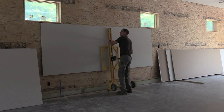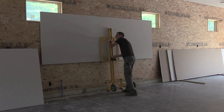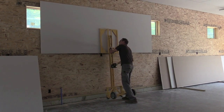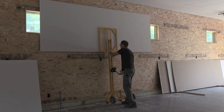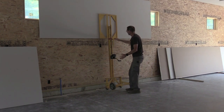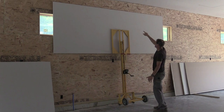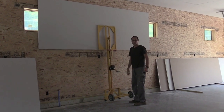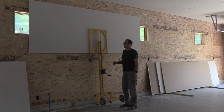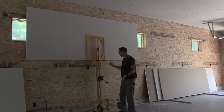Now I'm able to crank it right up to that ceiling. Once I get it close, I can maneuver it back and forth to get it exactly where I want it, then just push it up tight and hold it right in place against the ceiling. Because the bottom is slowly pulled out, your first fastener is along the top edge. Then you lower the cradle and you can fasten the rest of the sheet. This is a 54-inch high by 12-foot piece of drywall, and I'm able to lift and hold it in place without actually having to manually lift and hold it — this tool does all the work for me.